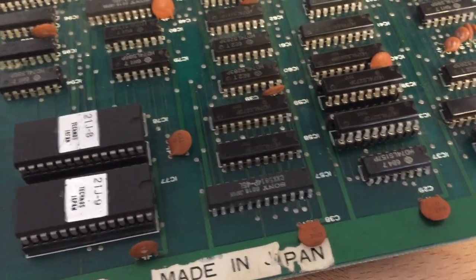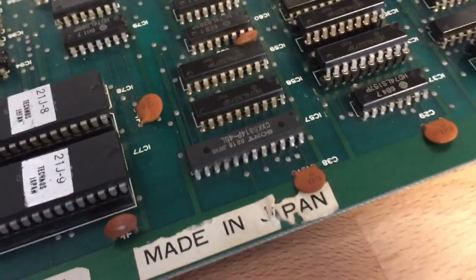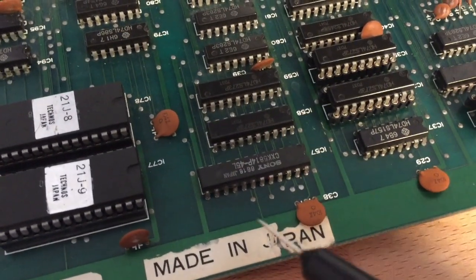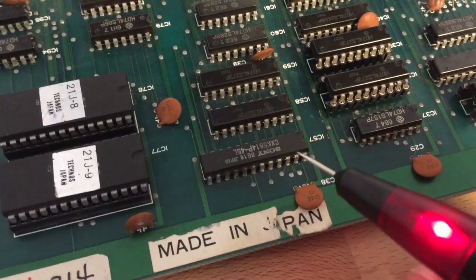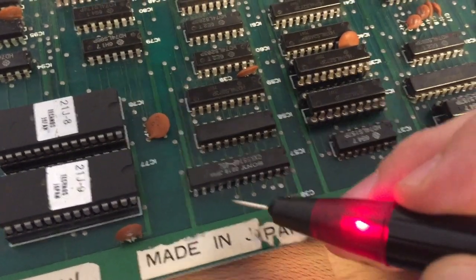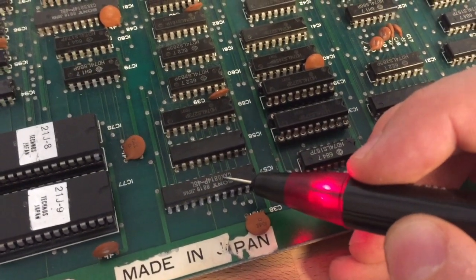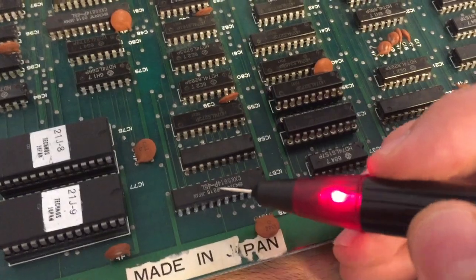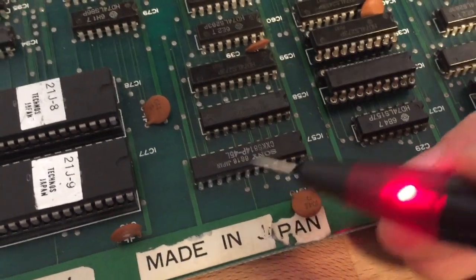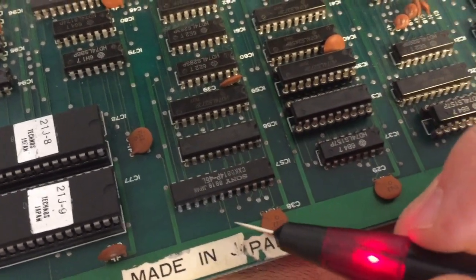And now we have to think about what could be the reason for one of the data lines being high all the time when it is not supposed to be. Well, actually two possibilities. Either the RAM on startup is being fed with wrong information, so it's being told that this line has to be high all the time for all the tiles on the screen, or it is actually being fed with the correct information and it is outputting the wrong data because the data lines of the chip are compromised. And both possibilities